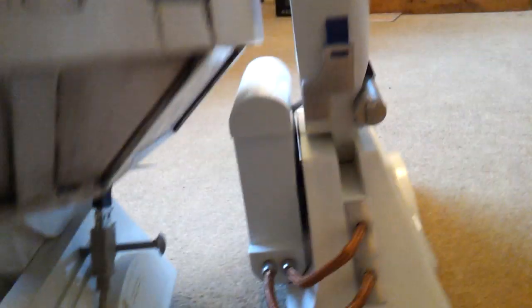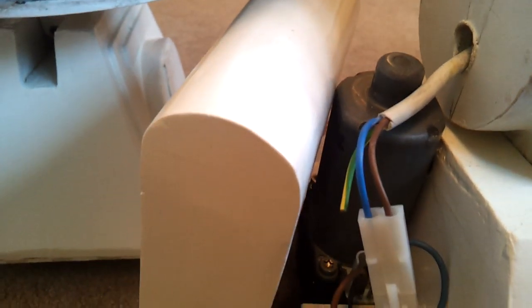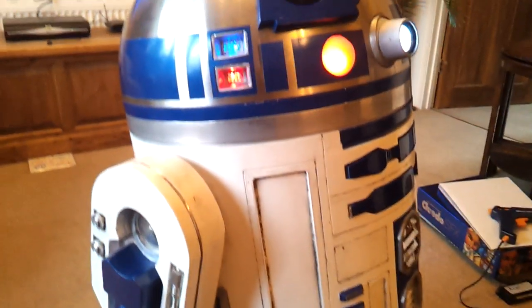Underneath here we've got the skirt. On this particular one we've got a USB port and power connections in there — at the moment just for debugging purposes, because it's autonomous and it's a nuisance having to strip it apart every five minutes. Then down here there's a small on/off switch and an auxiliary power unit for testing servo control without needing the heavier current required for the motors. The motors themselves are out of electric window winders — I think from a Peugeot 306 or something. And that's it — one R2-D2.